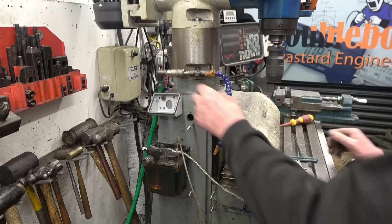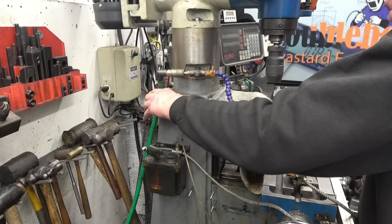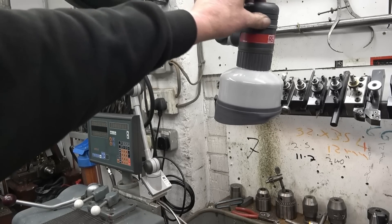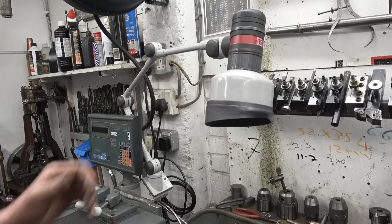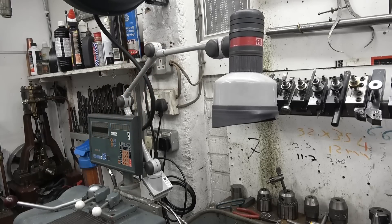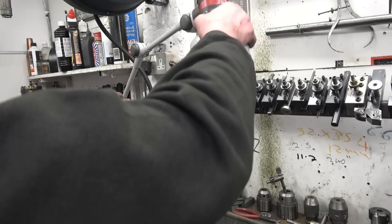In the meantime I've bought a couple of nice RS work lights — machine lights — because I've always been lacking light on the milling machine and the lathe. I've actually mounted one onto the lathe; I'll show that now. They're virtually unused old stock, 240 volts, which are certainly frowned upon, but with a modern RCD protector on the sockets it'll be perfectly acceptable to use, and there's only me going to use it anyway.